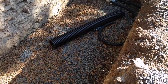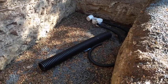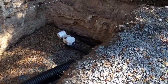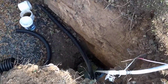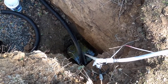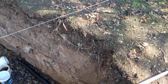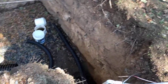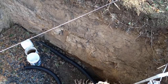You can see some French drain piping in there. I've got some perforated pipe looped all the way around to go into the corner sump, which is over here. The corner sump is about three to three and a half feet deeper than the rest of the pit. Right now I just have an electric sump in there temporarily to empty things out — we've been getting some unseasonably recent rain. But eventually there'll be both an electric sump as well as a siphon-based sumping system, so I shouldn't have to rely on electricity to empty this hole.